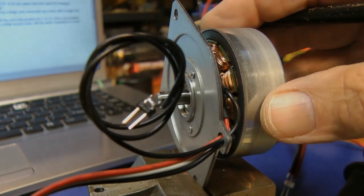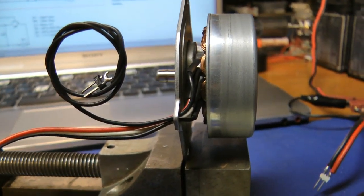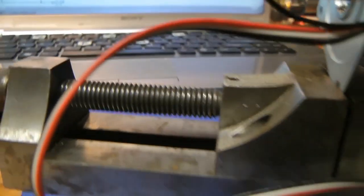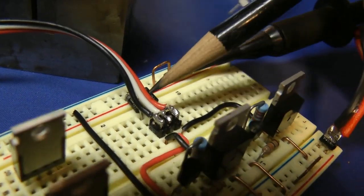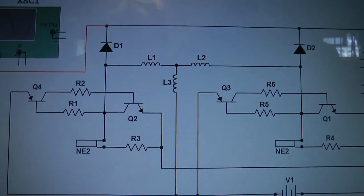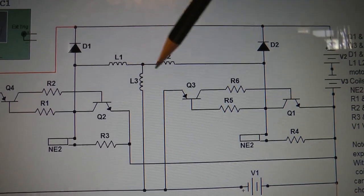This is a standard printer motor, just fresh off of a board and has had no modifications at all. And so naturally these are 3-phase. You'll find 3 wires that you can hook up to. I'm down here on the circuit board with the plug, and here's the 3 wires, 1, 2, and 3, and they correspond with up here, which would be 1, 2, and 3. And here's the 3 coils in the motor.